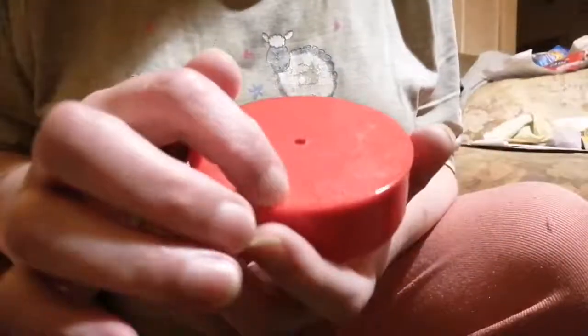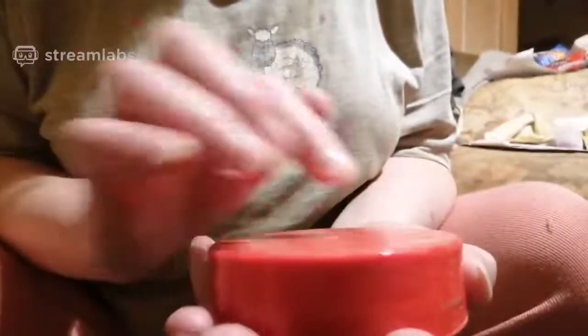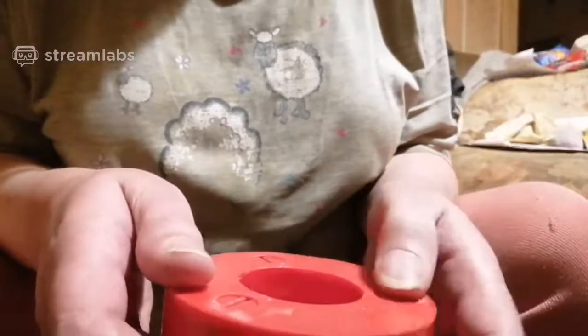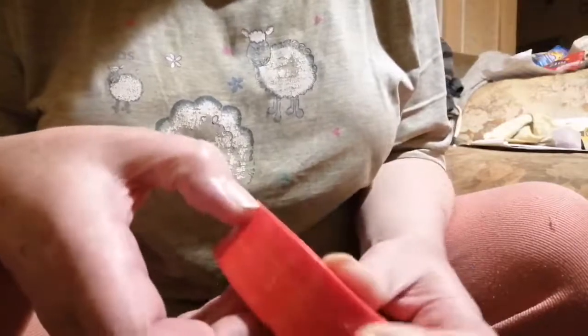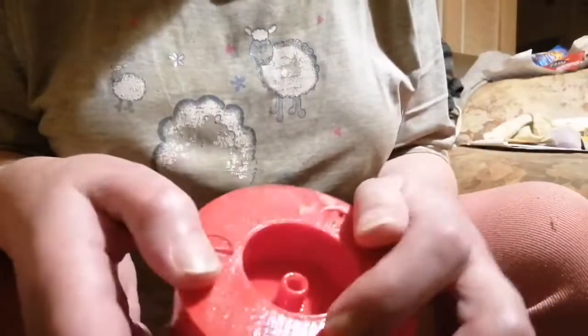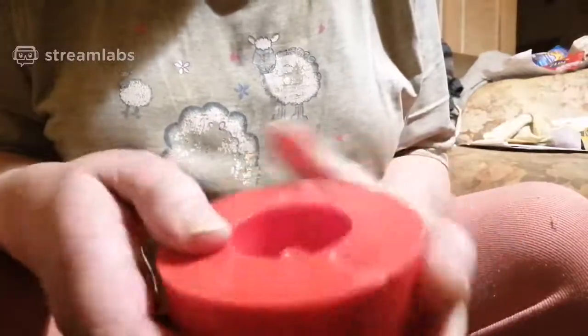I also have some tiny holes in the back of here so that I can push out the ball assemblies completely if I take this lid off. And if I want to inject plastic in there to permanently fix them in place, I can also do that. But I decided not to fix them permanently because they haven't got the screening material in there. If I need to add that at a later point, I'd have to stick a knife between the lid all the way around, which is easy to do because it's only that mild glue and it dissolves with alcohol. As you saw, I loosened these up with alcohol. So I could just use some alcohol to dissolve that glue which sticks this lid on, and take that off to get access to put the screening material in, which is optional for later on.